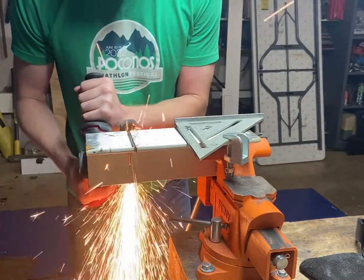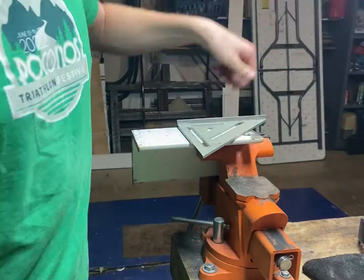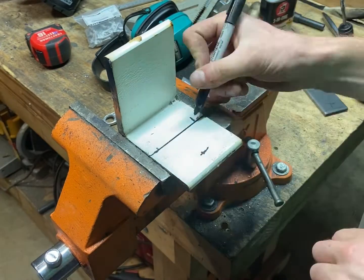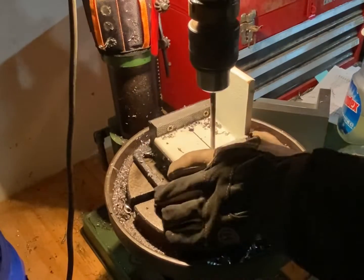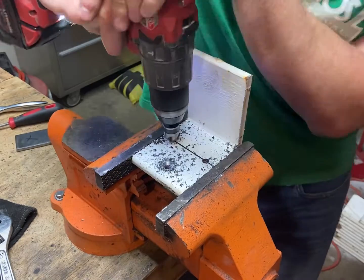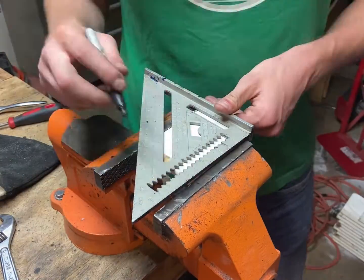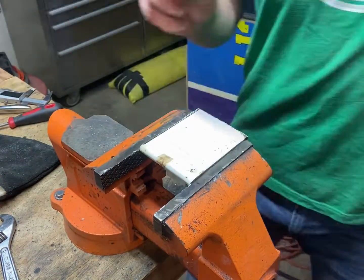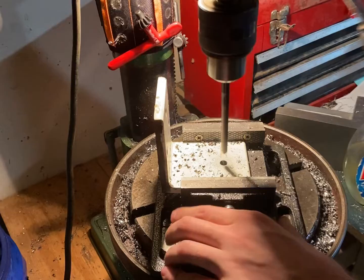This piece and a whole bunch of others like it were being thrown away, so I got them for free. Unfortunately I don't know very much about them, so I'm hopeful the other pieces don't have so much of this pretension in them, because it's really nice to be able to cut things with the circular saw quickly and easily. If they all have the same pretension, does anybody have any ideas of how I could cut these more easily? I'd imagine it's going to bind just as much on an angle grinder blade, and the circular saw binds pretty badly. I definitely want to use these pieces, but if I can't cut them easily that would be a problem.